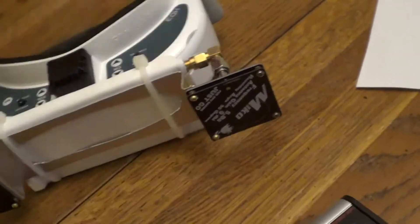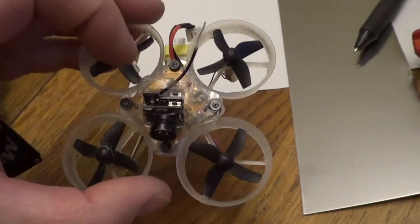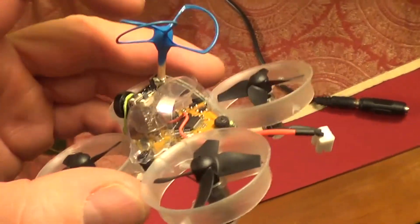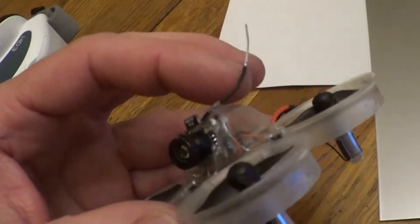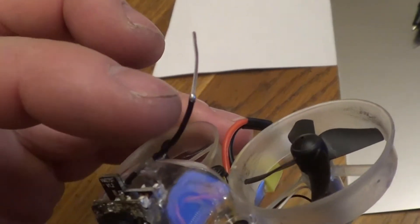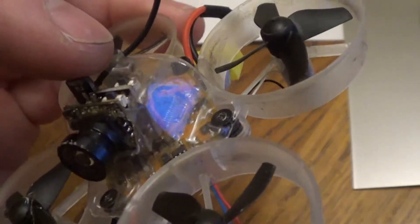So it's vertical. I use vertical polarization on my transmitter because I can do my tiny whoop at 18 grams by using this. You could also use circular polarization, but I get no difference between circular and linear polarization in performance. I can definitely trim off a gram just by using a piece of coax — it's soldered, a little solder, I think it's 12.7 millimeters — and then that's reinforced with a little bit of shoe goo.